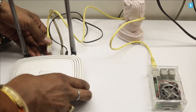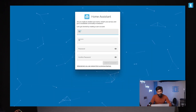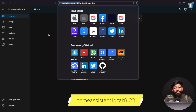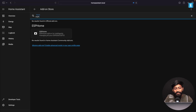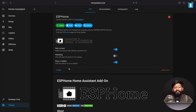For the Home Assistant part, first install the Home Assistant server. I installed it on my Raspberry Pi 4 — if you don't know how, I have a step-by-step video on it. Go to homeassistant.local:8123 once installed. Go to Settings, then Add-ons, and install the ESPHome add-on, which is great for home automation using Espressif chipsets like ESP32 and ESP8266. After installing, enable 'Show in Sidebar' and click Start.